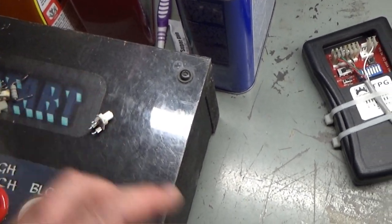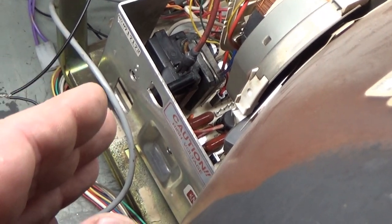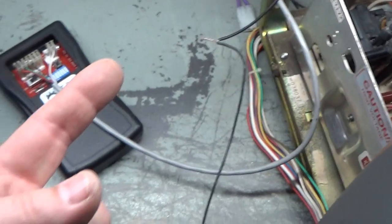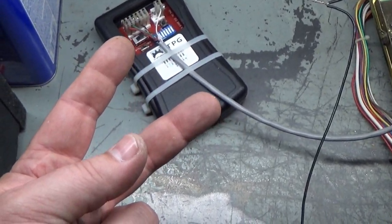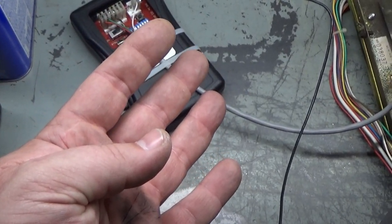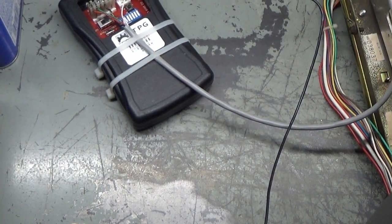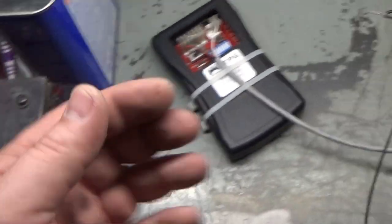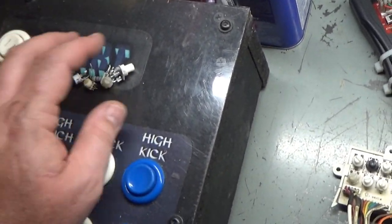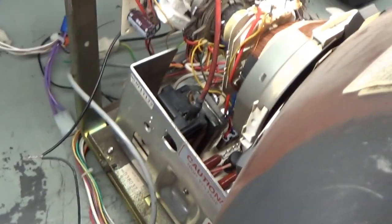So altogether, we had some bad solder joints that were likely okay, but because it was working, just collapsed. So we had some bad solder joints. We had a bad B plus pot. We had the wrong reading of blue cutoff pot. We had a bad green cutoff pot. And we had a bad R120. I think I'm missing one. I got five components here. Oh, and number six was the bad vertical size pot. So altogether, those were the cause of all the issues. So now I got everything adjusted and working perfectly.